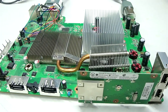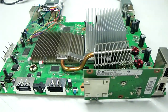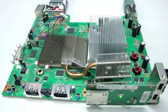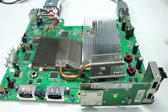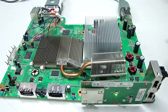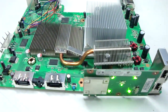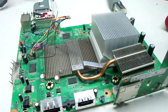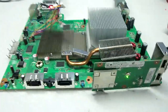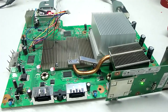The second boot looks a little bit longer. Let's try another boot. So it's still a little slow but it boots within 30 seconds — on average I'd say that's acceptable. Not sure I want to put two caps on the RST or not, but one cap on there is good. Two caps on the ground and PLL bypass, and I think you'll be good to go.